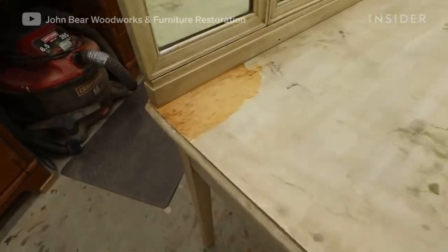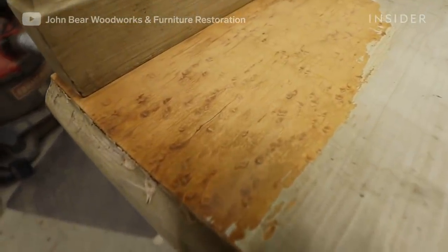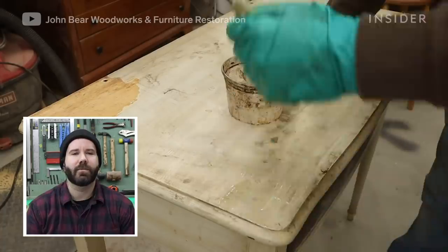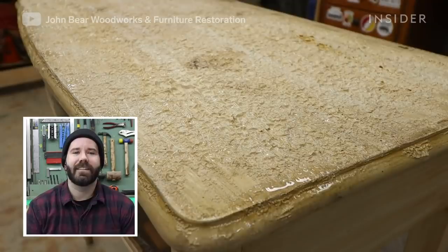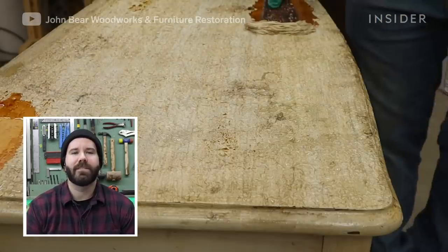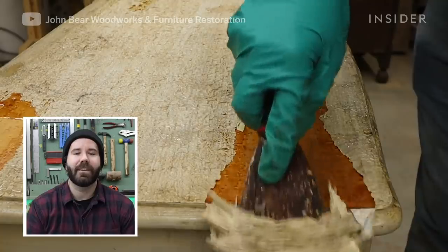Since I knew that this piece had been painted over with several coats of paint, I was just really excited to see what was hidden under there. I start by applying a gel stripper with a brush and I like to really glob it on. You've got to get it on thick and then let it sit. It can't be dry — it has to stay wet so it's working. Then once you let that sit for 15-20 minutes, you can really start scraping and finding out what you have hiding underneath your projects.